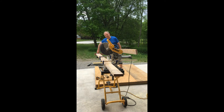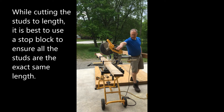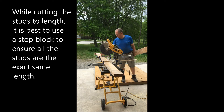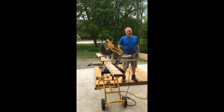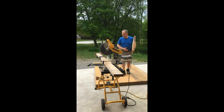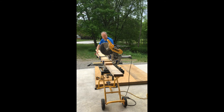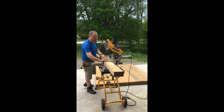At the far end I have a block of wood screwed to the end of this piece of wood that I've clamped to the saw, so this piece of wood won't move. With that block of wood screwed on at the exact distance from the blade, I should be able to cut all of the studs accurately without having to measure them over and over again. I just have to slide this piece of wood inside because of how the clamps are positioned, then pull it up nice and snug against the block of wood and make sure it's tight against the fence for a nice square cut.